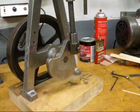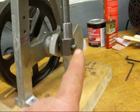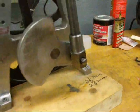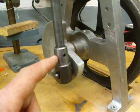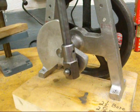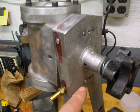It's been at least a week, maybe a little more, since I made that last video of reaming this hole. But now I've got the crank on there and the crank pin in. You'll see that we've got a set screw here and the hub is now thick enough to accommodate that. Several other improvements I've made: I reduced the diameter slightly where my finger is touching and then pinned it with a roll pin so it won't come loose. You'd be surprised how things can hammer themselves into looseness. And on the top side, all of the plumbing is now indoors, if you will.